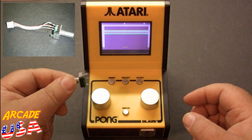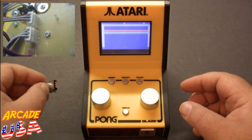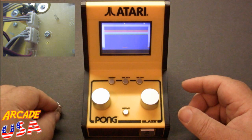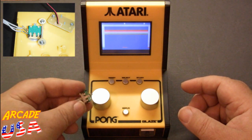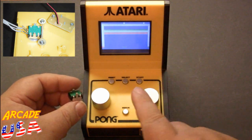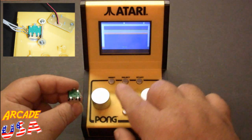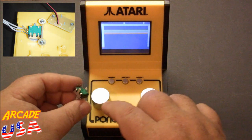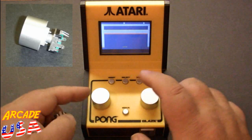From there, I unplugged the old encoder board, cut it off, and soldered the new encoder onto the existing harness, then plugged it back in. I did a little modification to retain it inside the housing — basically I took a piece of a tie wrap, cut it to fit into the original groove to hold it down, super glued the body to that, and then bent over one of the tabs and super glued it to the top of the circuit board.